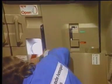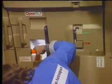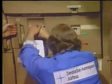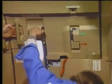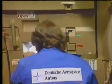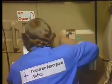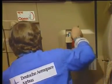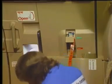Hold the passenger crew door to prevent it moving outboard and set the door control handle to the open position. Make sure that the girt bar has engaged correctly with the floor attach fittings. Set the door control handle to the closed position. Set the emergency control handle to the disarmed position and install the safety pin.